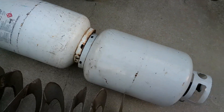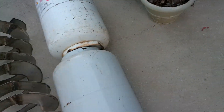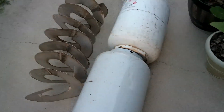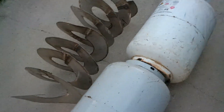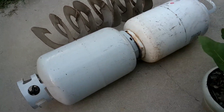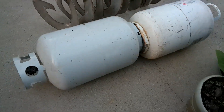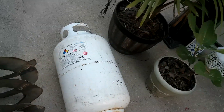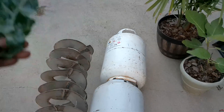People keep saying welding this is going to make the material structurally weaker — don't do it. But let me show you something. See that right there? That's a weld. These propane tanks are welded as is. They use machines — a form of welding called sub-arc welding, which is machine-perfect. And this is carbon steel, the stuff I've been welding for all the years I've been a welding student. On the reactor that exploded three times, not once did any of my welds ever fail. Welding high pressure vessels is absolutely possible.